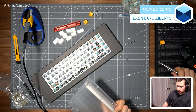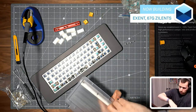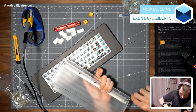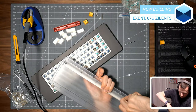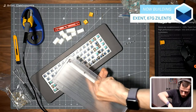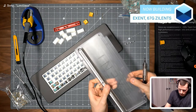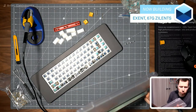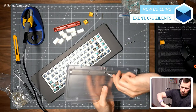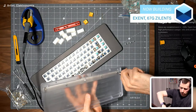Now, because my polycarb is not cracked, I'd like to keep it that way, so I'm going to be really careful here. I'm not going to use the auto screwing feature here just because I don't want to go too far and accidentally break these. So I'm just going to loosely get them in and then make sure that this is seated correctly. I want it to be in its groove. Do not over tighten. Good.